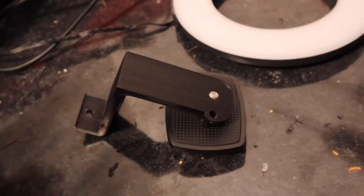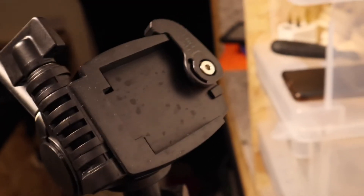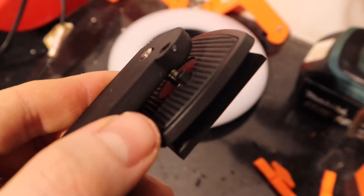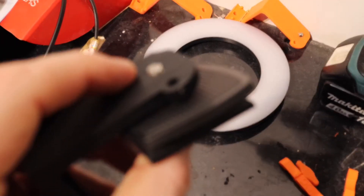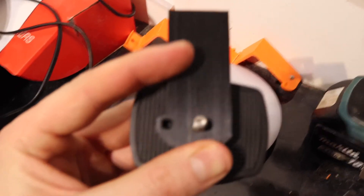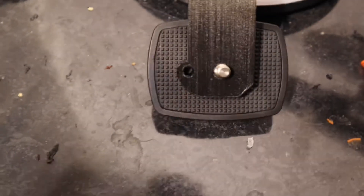I'm back to holding the camera to try and show this as best I can. You can see here this is the little locking plate, angled in different ways - this sits on top and this lever pushes to unlock it so you can take the camera out. And you can see that locator pin on the plate there - that's the bit I made that hole for. When I tighten this up, that locator pin goes into that hole and it ensures everything sits straight.